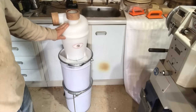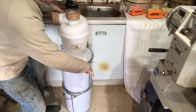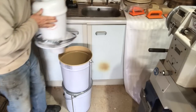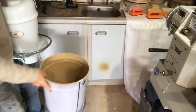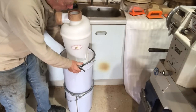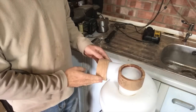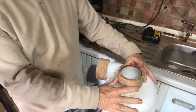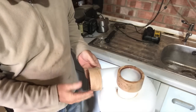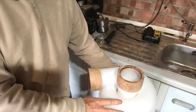I've got it all connected together, two tins connected together. The simple operation to empty it is to take that away and obviously empty the sawdust, then connect it back up again - another simple operation. I had to turn a couple of shrouds just to build it up to 100mm so it would fit my hose. Just epoxied them on - there's no way they're going to move now. All that's left to do now is fit it in place and then obviously test it out.